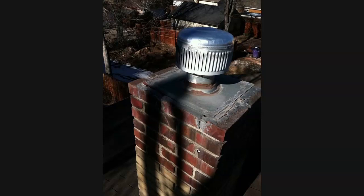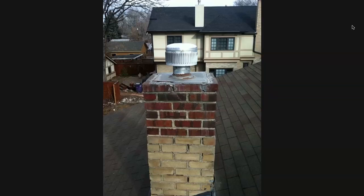But it's got gaps around it where water can seep in. Another thing across the top of this chimney, somebody had tuck-pointed this — probably about 8-10 years ago. It's cracking in a lot of places. It wasn't a great job when they did it. Here in the second picture, you can clearly see cracking in the hard mortar at the top, and the mortar at the bottom is just wearing out, essentially turning back to dust. And in these head joints in particular, you can really see they're just empty and wearing away.